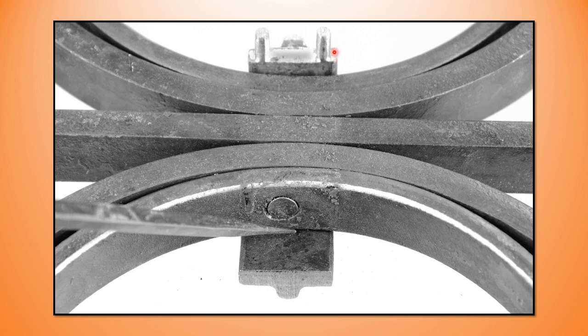Once you've got one side fitted, then I'm going to offer up the work that I've done to the grill, and I'm going to scribe a line here. Remember, that's going to be a curved line, so you're going to deal with this mark and this mark, and now you can start to look at putting the mortises in for the second side.